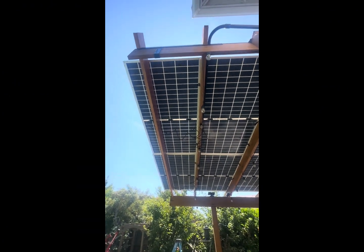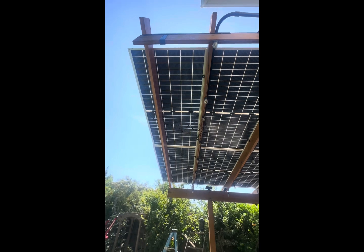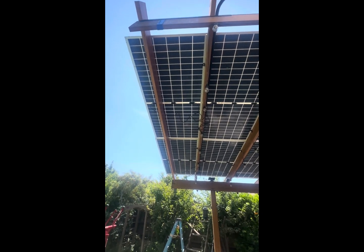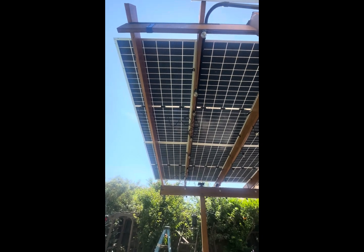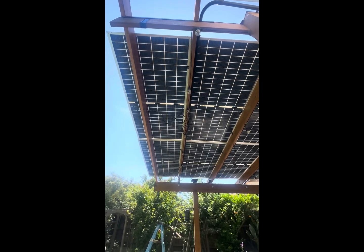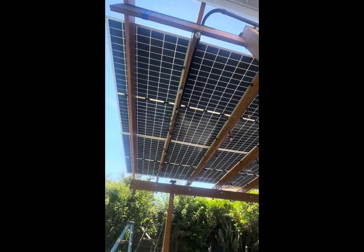Here's the other side — I got the 2 panels installed. They're bolted down on one side, not the other yet. It is an overhang and I do have to adjust the panels because one of them is out like a half inch too far. It's all hooked up and I hooked them up at nighttime. You don't want to connect these things during the day because there's 250 volts DC running through it and it'll arc as you try to unplug it and weld the terminal.